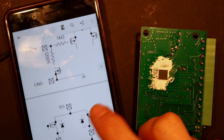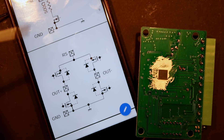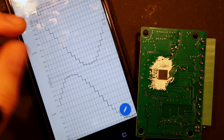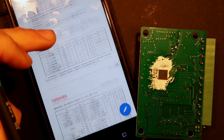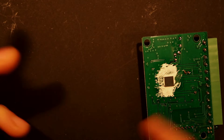There's a motor oscillator pin — that's probably what they're using the 555 chip for, running in some kind of astable oscillation mode. The current reference setting is probably these components down here. The RS pins are the power for the output stage: high-side, low-side, and the two outputs so the phase goes between them. This driver uses microstepping: on each clock edge they adjust the current output by a percentage, such that the resulting current — and therefore voltage to the motor — forms a kind of sine wave, making it nice and smooth. This looks like a decent chip; for a cheap Chinese product to actually use a Toshiba chip is good.